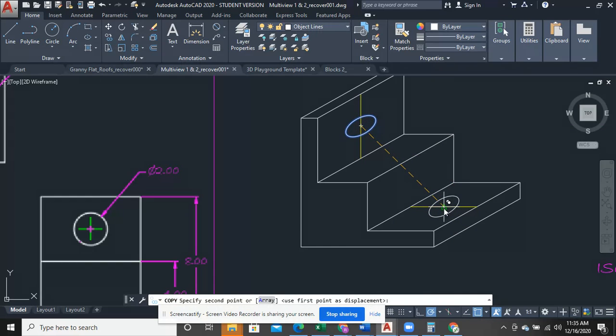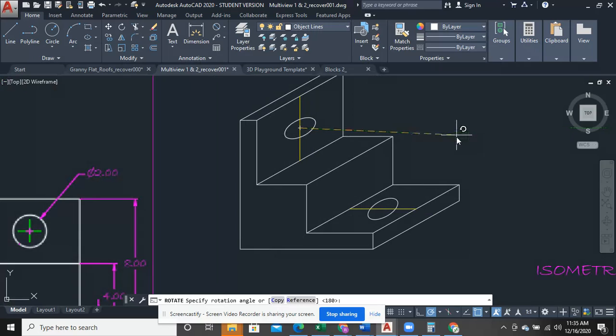And it's the same principle down here. So all I have to do now is go through a rotation. So I'm going to come up here, select rotate, go down this way, and I'm just going to keep going. I kind of move out so I can see that 30-degree polar line, and I just move down, and every time I get to another one of those increments, I check to see if I'm achieving parallelism. And in that case, I am. I can see that hole appears to be parallel through there. And in this one, you can see something is still a little bit out of whack. So I'm going to go rotate, select this, and go every 30 degrees until that hole appears flat.